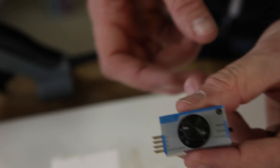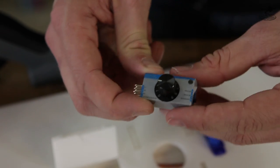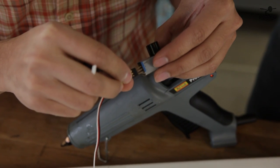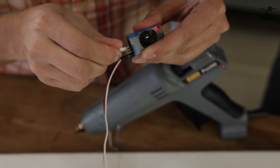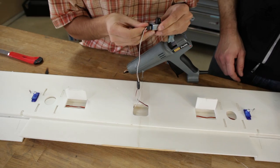This is just a simple $5 servo center that we use. It has manual center, and then actually pulses back and forth. They work really good. Just keep in mind, use this on a single cell battery, not a 3-cell or a 2-cell. You're going to burn everything up. The reason we pulled this out now is so we can recenter these servos. There you go, there we are.